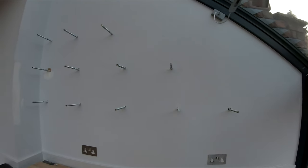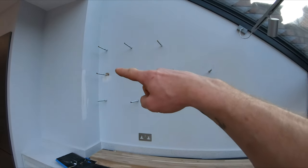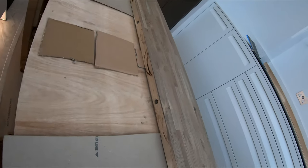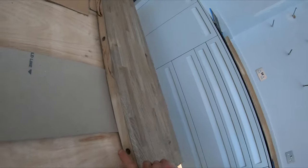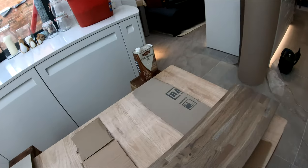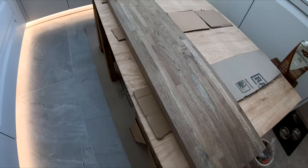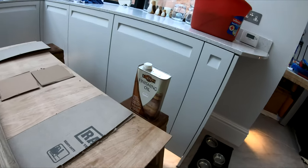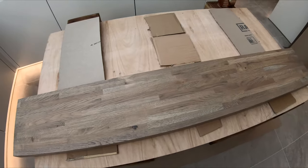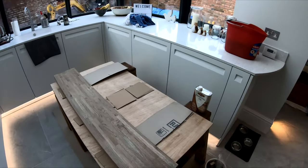The threaded bars are in the wall, all nice and level. I've now drilled the holes in the backs of the shelves — we offered the shelves up, held them on their back, marked the points, centralised them within the shelf, and drilled using a 16mm auger bit. Before mounting, I need to apply some oil — I've already applied the grey oil, the same as the breakfast bar, which is basically a wash: put it on and wipe it straight off, it just stains the grain really nicely. Then we apply a finishing oil to make it more hardy, because stuff will be put on and off these shelves so they need to be protected. Although oak ages nicely over time, you still want to make sure it's not going to get damaged too easily. I'll set a time lapse so you can watch this process.